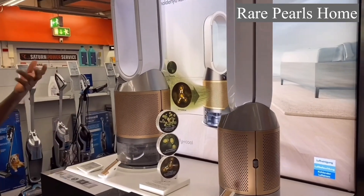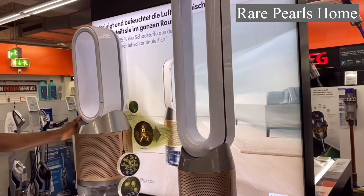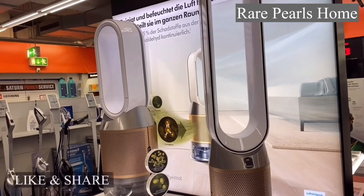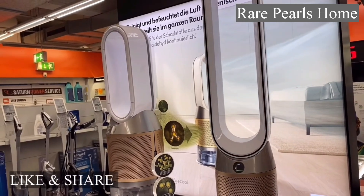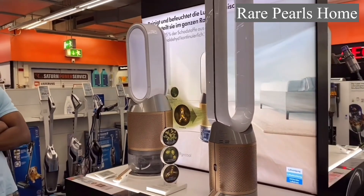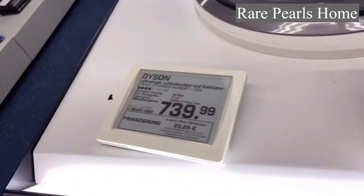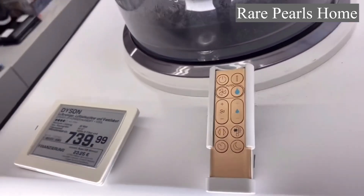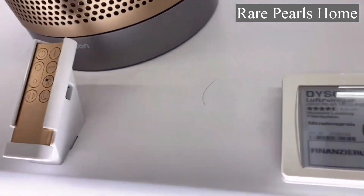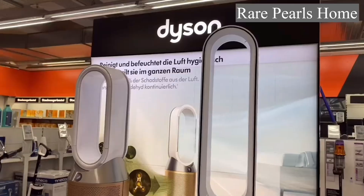The expert advises: to decide if you need a humidifier, check whether your room is wet or dry using a hygrometer. If the room is already wet you don't need a humidifier — it's not good for you and can cause mold. The ideal humidity range is 45 to 60 percent. If it drops to 35 or 40 percent, then you need a humidifier. Above 60 percent is not good for you.